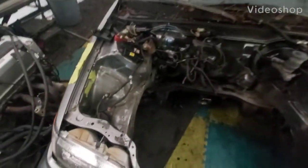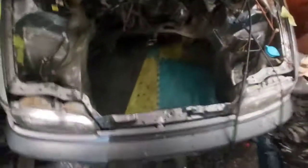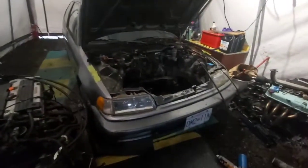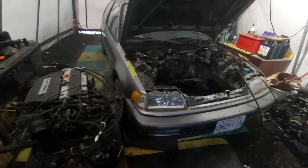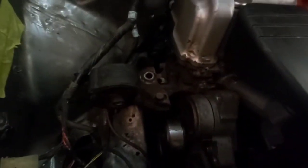I've got the passenger side transmission mount drilled and knocked out of place. The little brake line bracket that was on the strut tower got removed. Dragged the front subframe out of the corner using some round tubing — kind of like how the Romans did it — one tube in front of the other. Actually broke the pallet, so let's get this in place and make some motor mounts. The engine is in place, done on the pallet, mocking up some motor mounts.